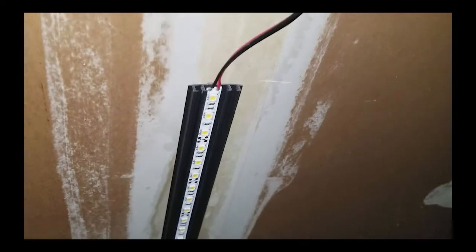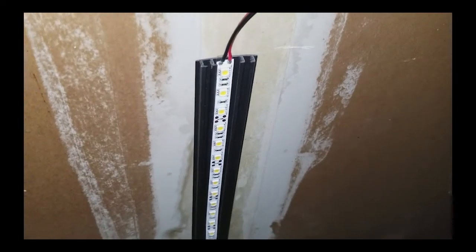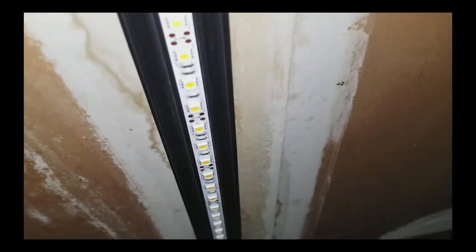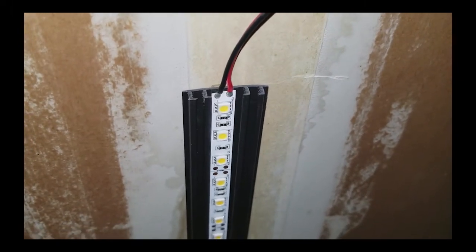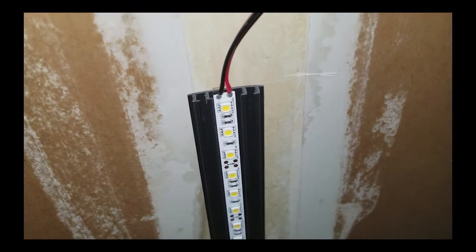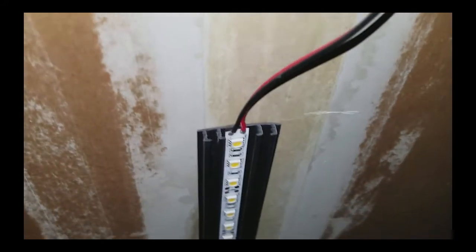I have the lights turned off so they don't flood out the camera. These are a ribbon-style LED light totaling 16 feet in length. The backing you see is a one-and-a-half-inch porch screening system base strip which I purchased from Home Depot. These come in eight-foot lengths, so I needed four in total to install the two 16-foot LED strips. Using these was recommended by a friend of mine who professionally installs LED lighting. He said the advantage is that they are easy to install to walls or ceilings using screws and they provide a predictable surface for the LED strips to stick.